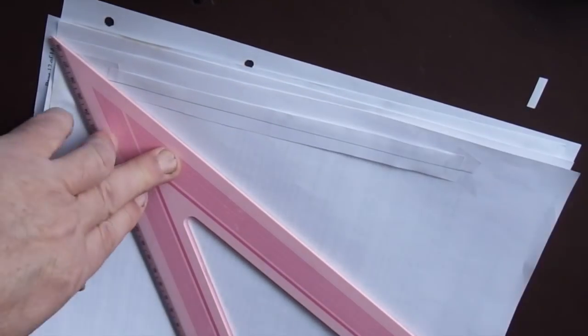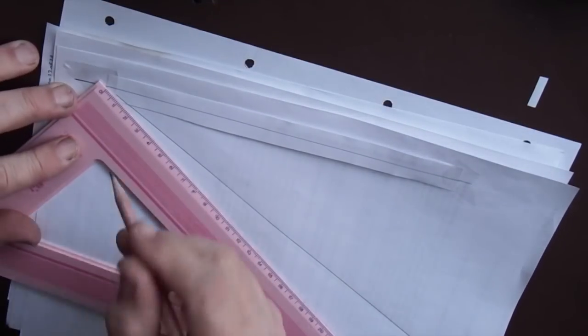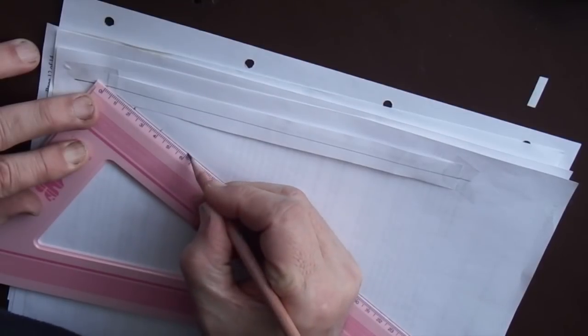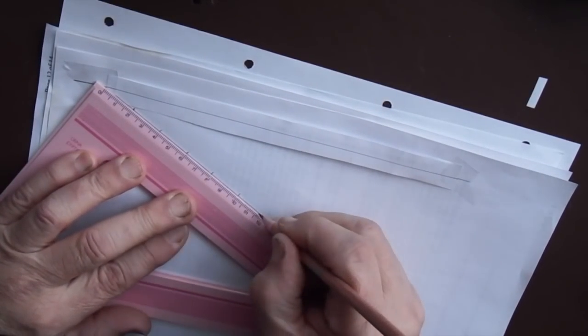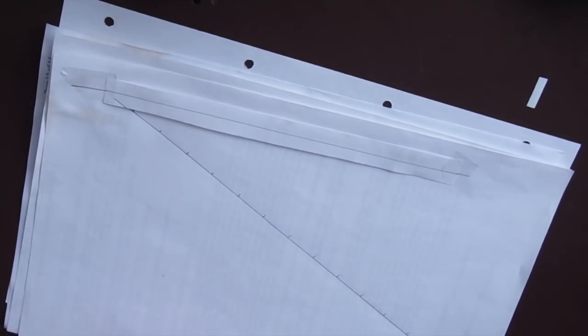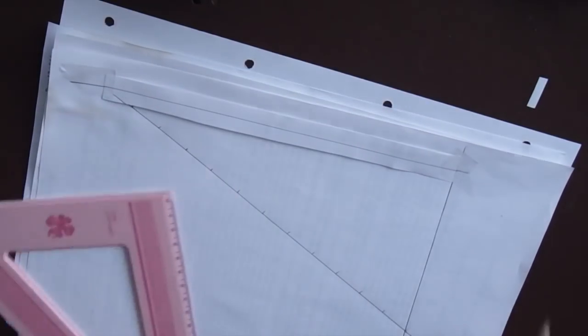With a square, draw a line any length and divide that line into the number of indexing positions you need, in this case 12. Once you've drawn the 12 lines, mark the last line to the beginning of the strip.